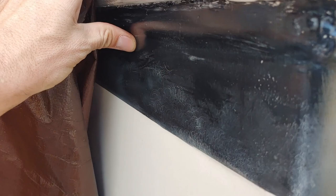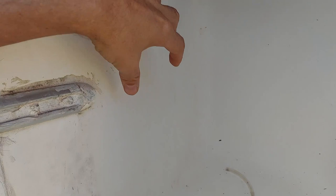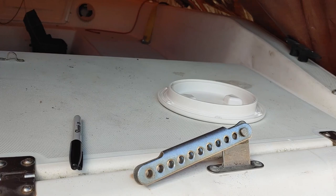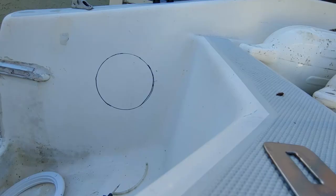One of the issues I have is the lazarette keeps filling up with water, most likely because of this separation here. My hull has separated from the bump rail — the rub rail — and I can actually get my hand up in there. So today what we're going to be doing is putting an access panel in here, which will give me access into this tiny little area to stuff it with styrofoam and hopefully hold this part out while I glue it. Let's see how it goes.